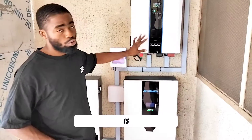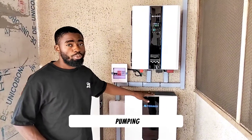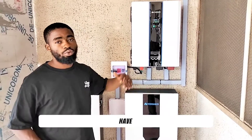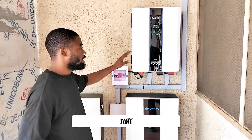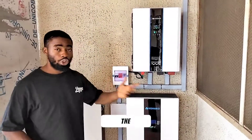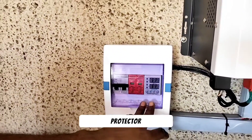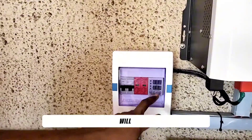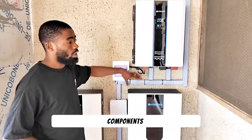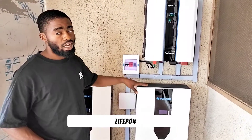Everything here is good to go. The 10-kilowatt battery comes with a 5-year warranty. This system can power your pumping machine, washing machine, deep freezer, and TVs. In the afternoon, you don't have to turn off one load to turn on another — you can run them all at the same time and still have energy coming from the solar panels. The standard components here include a DC breaker, an SPD, and an adjustable voltage protector. The voltage protector shows the current and voltage coming from the grid. These are the components of a complete 5kVA system using a 10-kilowatt LiFePO4 battery.